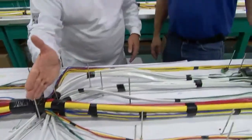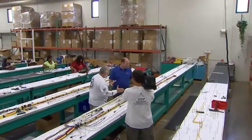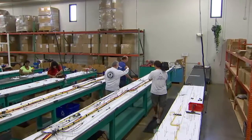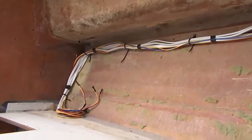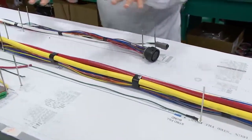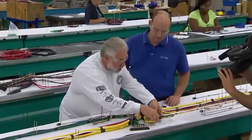Where are we at in the boat? We're just forward of the head. Right here we have the ACMDP — again, plug and play. All the interconnects are taken care of by us, so the quality is top notch. We're continuing forward, up to the bow — nav lights coming in, windlass cables. Now we're turning down the port side. This is two tables of wiring harness. Here would be where the galley is, with all the connections at the galley. Back to the dash area, then heading aft to the cockpit. We have plugs for the T-tops — all plug in place, so if the customer needs to remove the T-top, you don't have to cut wires.